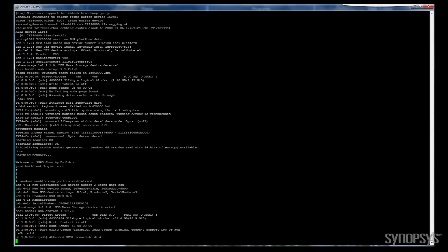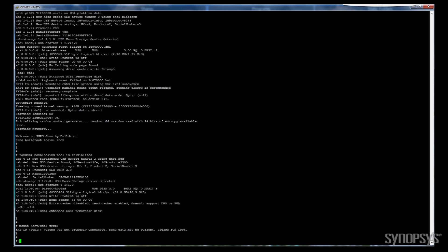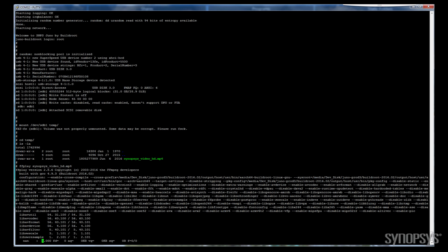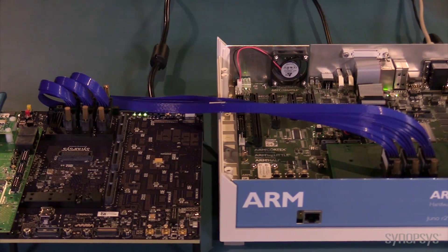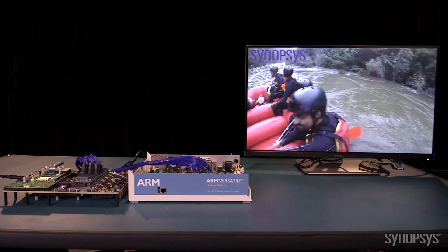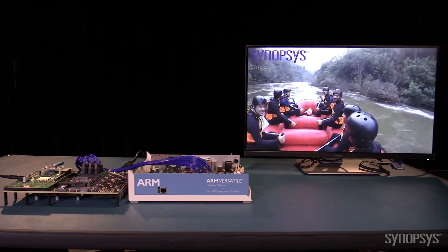The system uses the USB 3.0 driver from the kernel mainline and I can run any standard Linux application. Once we have the setup running and the USB stick properly enumerated, I will stream a video to the LCD. This video file contained in the USB 3.0 stick is processed by the USB 3.0 controller, sent to the Juno ADP, sent to the HDMI output, and displayed on the LCD. Getting the reference design up and running is that fast.